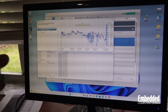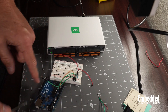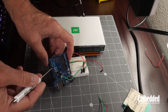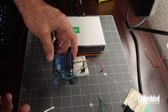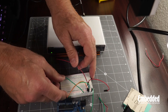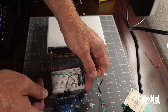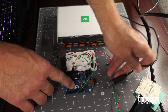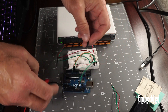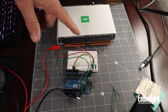This setup is meant to measure the voltage drop across a 33-ohm resistor, which will allow us to get the current going into an Arduino Uno. I'm going to measure with a blinking LED so I can see the power difference between LED on and LED off, and see how much current this Arduino Uno uses. It's blinking under USB power, so I'll take that out and move to an external power supply. The positive will go through the 33-ohm resistor, which is how we can measure the actual current going into it.